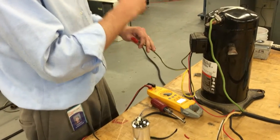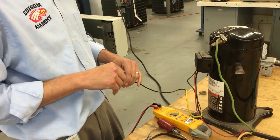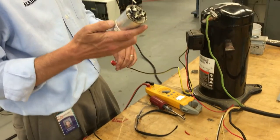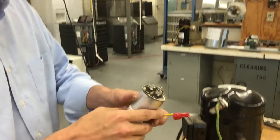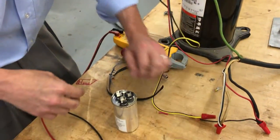If compressors seem like they go bad and aren't working, this is the first part I tell people to check. Normally you can see if they're bad — they'll be bubbled up on the top and look pregnant. They call that a pregnant capacitor.